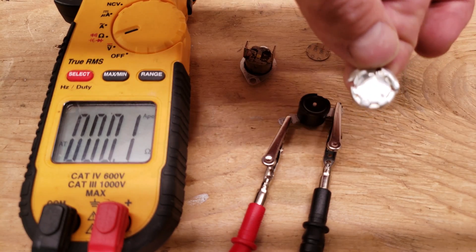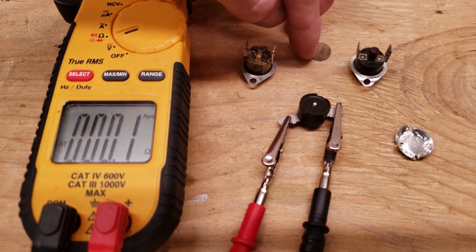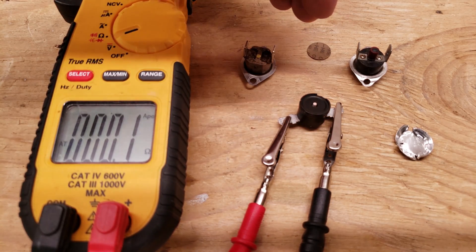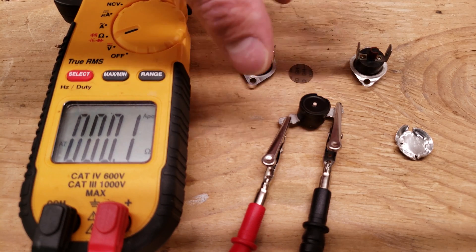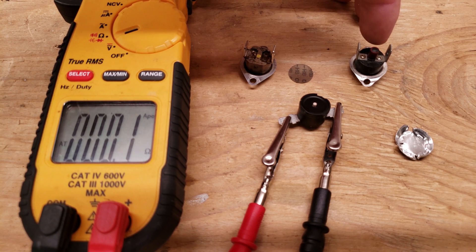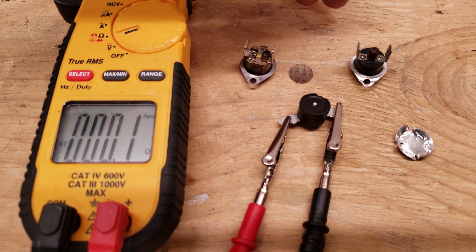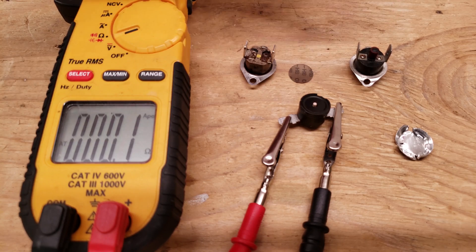To get at this, you see that we took this little aluminum plate off — they're trying to protect that little sensor. All this stuff is very precise because they have different temperature measurements, and you really want to be careful not to be pressing inwards on that on a functioning sensor. This one's an automatic reset and this one's a manual reset. The manual reset are typically used near the combustion chamber of a furnace — if the flame came back at the sensor this would trip, and you wouldn't want it to automatically reset; you'd want a technician to manually reset it.